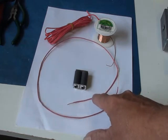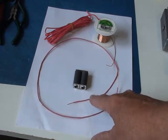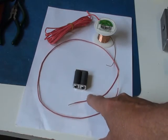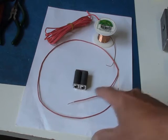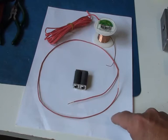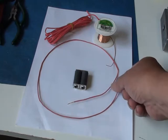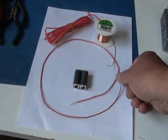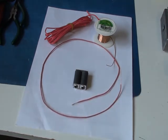In fact, applying a lot of heat to the heat shrink tube, it basically doesn't melt — it just sort of goes all funny and soft. And it's unlikely your amplifier is going to hit 480 degrees C. If it does, I'd say the amplifier is in big trouble. So heat shrink over the enamel copper wire might be a good temporary solution if you can't find any Teflon wire.